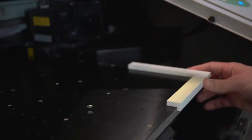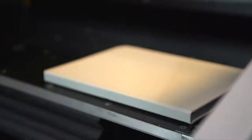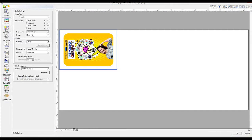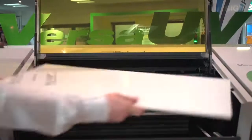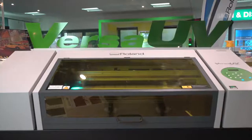To quickly and accurately place items with a right angle or a straight edge onto the bed, you could create a small corner guide such as the one shown here to locate items at the zero-zero position on the bed. You can use your corner guide to align your item to that position. Once your item is in the zero-zero position, you can quickly align your artwork in the RIP software, especially if your design is the same size as the printing area of your item, as there will be no need to adjust the printable area of the machine.